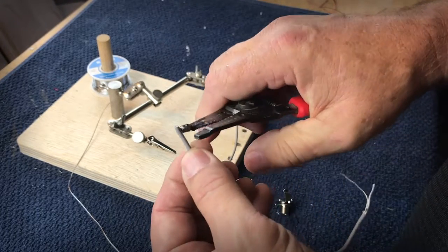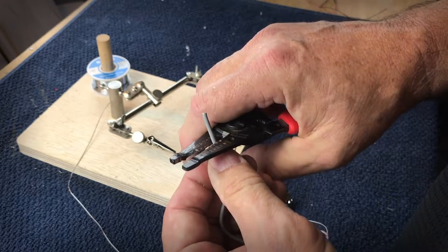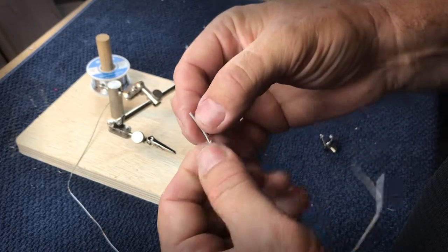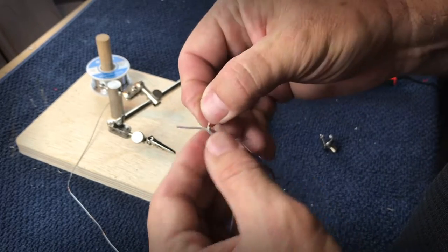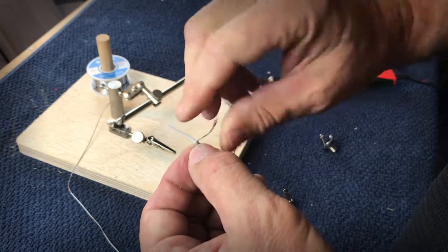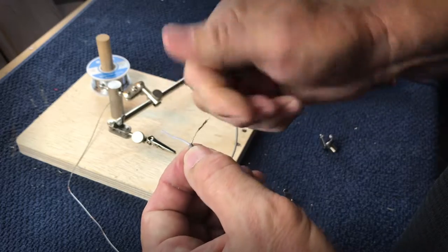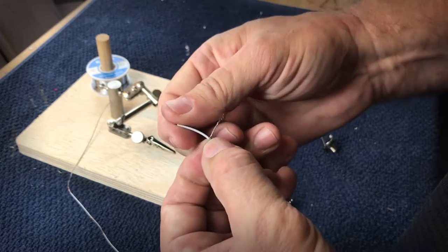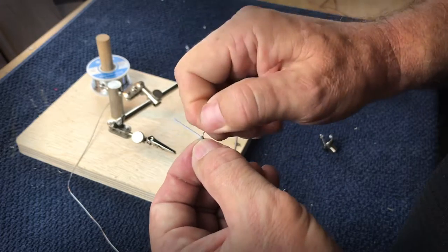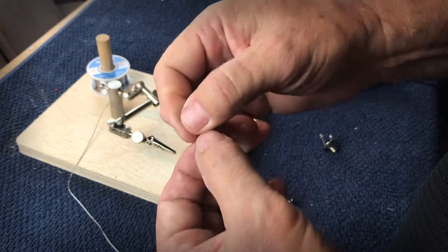If I'm using some wire, what I do is I come in and I strip it back, at least an inch, and pull off the outer insulation and then open up the inside, and what you'll find is there's usually a jacket. And what I'll do is, again, I'll twist those wires together, get them all pulled together, make sure and look that you don't have any strays laying in there, because those are a potential source of a problem. So I've got the outside jacket pulled together and I've got it all spun up and it looks pretty good.